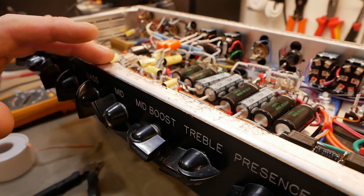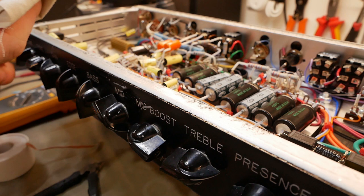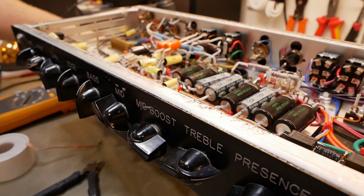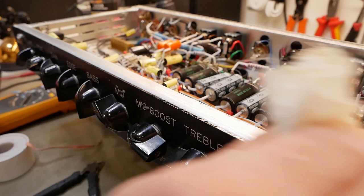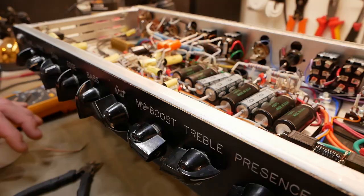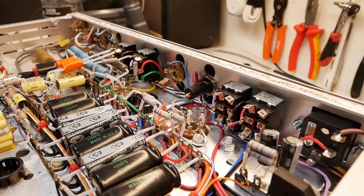Before I go any further I'm going to clean off this gooey crap because it keeps sticking to my arm hairs. It doesn't appear to be water-based, so we'll go up the ladder to shellite — otherwise known as naptha. That's getting it first go. Naptha doesn't really hurt anything except you if you set it on fire, but the point being it won't dissolve any plastics — it's polite even on nitrocellulose, which is saying something.